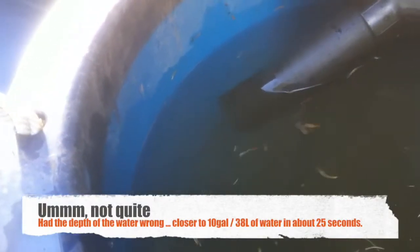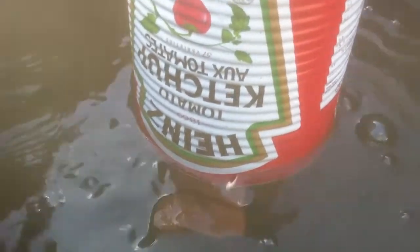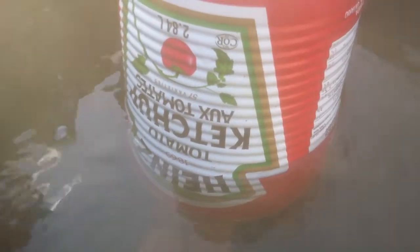And that's it — just that fast, 15 gallons or 60 liters worth of water dumped. You can see now that the water level's starting to come back up and everything's running just fine. So it runs pretty quickly, actually. What this tells me is that as long as the can is just bigger than the maw of the pipe and I have the reducer on it, I'm okay. Without the second reducer underneath, it won't run — it doesn't actually cycle. The water drains too quickly and never drowns the intake pipe the way it's supposed to.